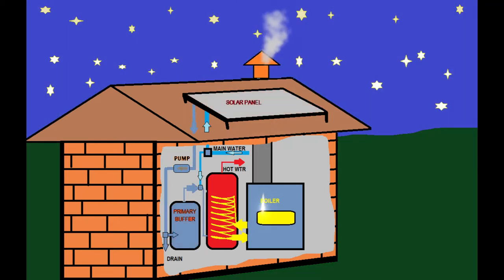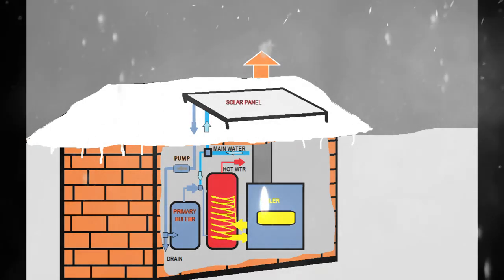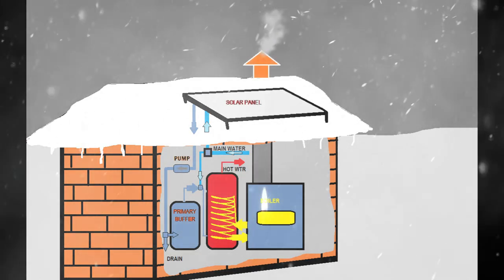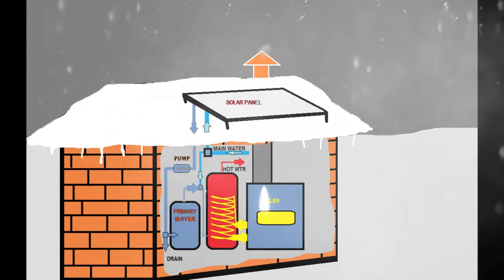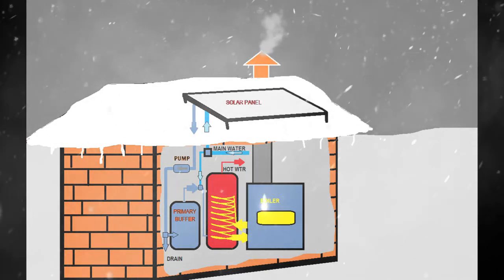In the night time during a hot summer, if the main water is very cold, it will still pass through the solar heater panel. Even without sun, there will be some heat exchange if outside is 25–26 degrees, and the water will be a little warmer than normal. But in the night time water consumption is at minimum. In winter, we make the system redundant — the main water goes straight into the main heater tank, the solar panel is bypassed and drained, so ice cannot destroy the system.